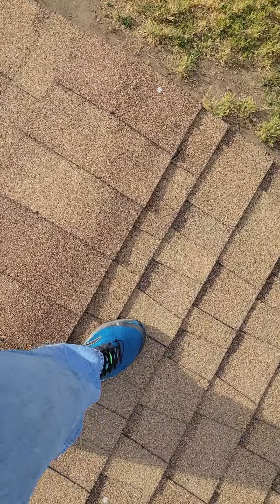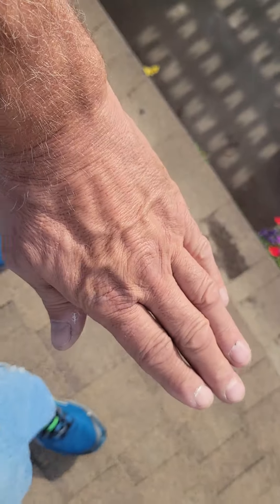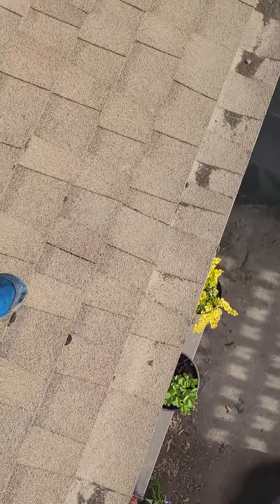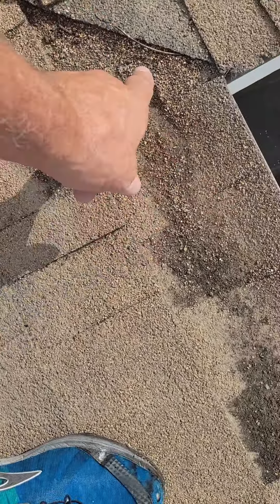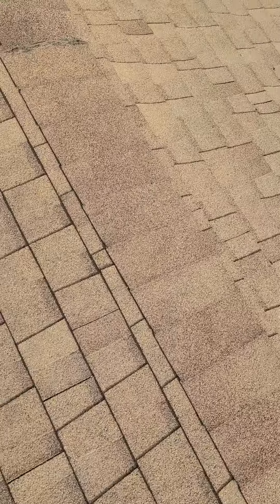I'm not replacing all of the wood — I'm replacing some of it, fixing it. Like right here is another spot. I'm taking this off, throwing away the drip edge. See how the water's not going off because the edge is higher than the roof itself, so it's going up and settling there — it's just not working. In your valley area the water's not running off; it's going up and back in, and thus you've got problems.